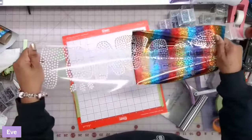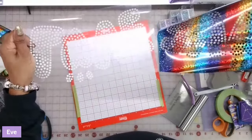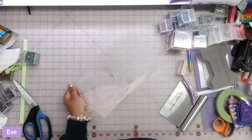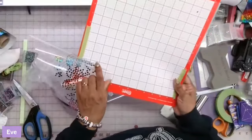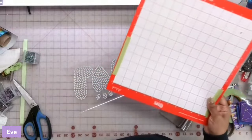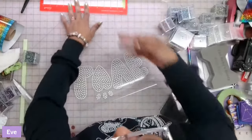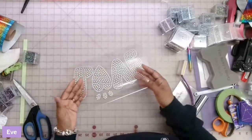So don't get upset when someone gives you recommended pressure and it doesn't work. You gave me the wrong pressure, or I've been using that pressure and it's not working. Increase the pressure. Sometimes you have to have a fail. Because sometimes even a small section of a test cut will not turn out properly. You know, I hate to say that. Sometimes you got to waste a little bit in order to get it right if you've been using your machine a lot. Okay.